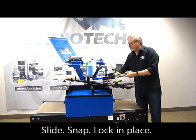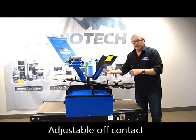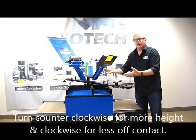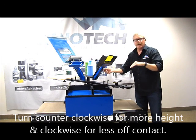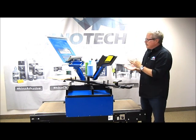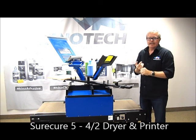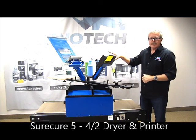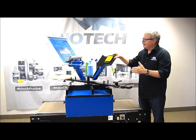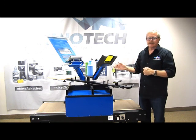I can adjust my off-contact again. If I want to work with in-contact or off-contact, I just screw this counter-clockwise to give it more height, or clockwise to bring it right down on top of the bed. This is a really straightforward unit — the SureCure 5-42. Four printing stations: if you're doing caps, you can do it that way; four stations for doing t-shirts. With one machine, it gives you that flexibility.